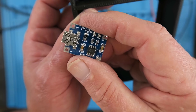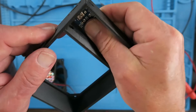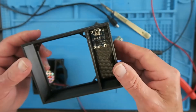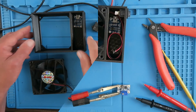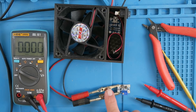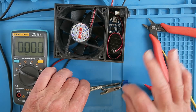The TP4056 being a USB 5-volt lithium cell charger — I'm not entirely sure how it was supposed to be mounted; there are these holes, and I think that probably calls for some hot melt glue once the wires have been soldered onto it. That's about all there is to it. While the front fan cover and the cover are being printed, let's go ahead and assemble this. Something I forgot to mention earlier is that we're obviously going to need some form of boost circuit to take the single cell voltage up to 12 volts for the fan.